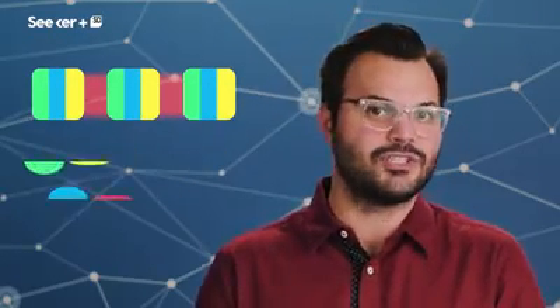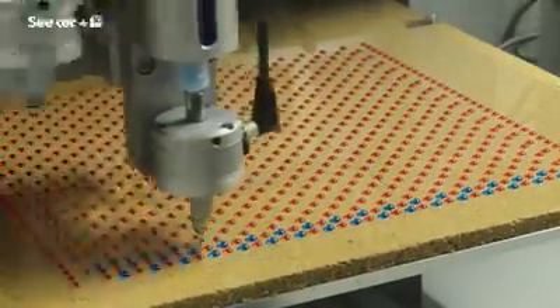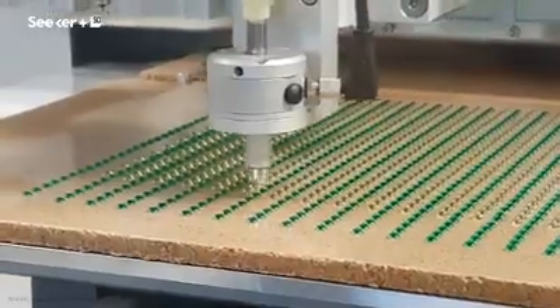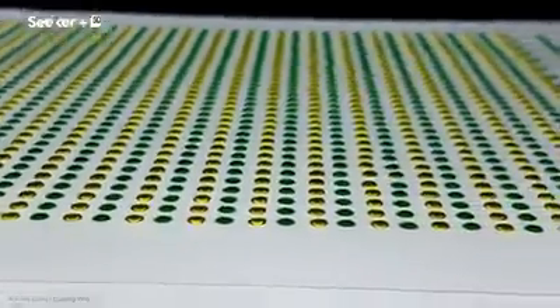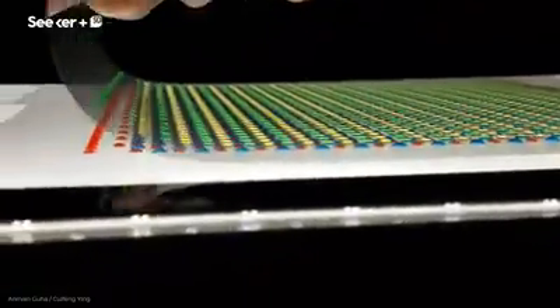They looked at each component in the eel's electrocytes and mimicked the same idea into alternating patterns of saltwater and freshwater hydrogels. Saltwater has salt in it, obviously, meaning it's an electrolyte. Here the red gels are filled with saltwater, and the blues are filled with freshwater. At the points where they touch, the negative ions from within the saltwater flow toward the empty freshwater. The yellow and green gels on the separate sheet are filled with specialized fluid that don't just let the ions flow willy-nilly. Instead, the yellow gels only let negative ions through, while the green gels only let positive, and together these colorful gels move the ions in a very specific direction, generating a voltage.